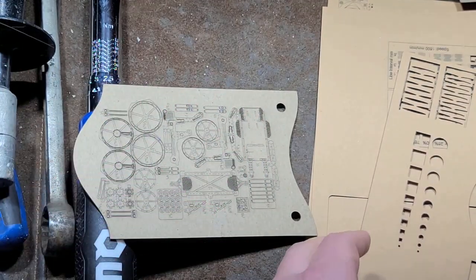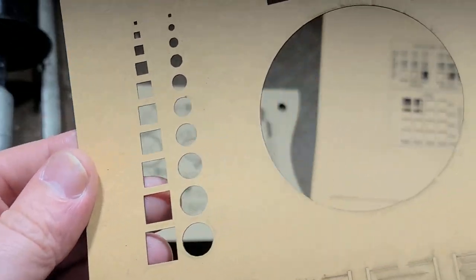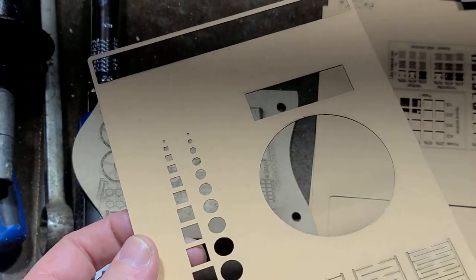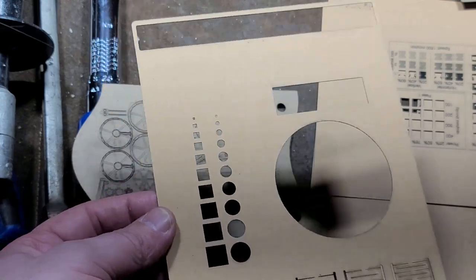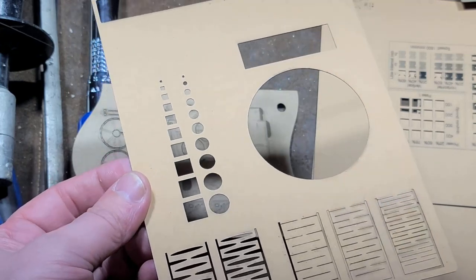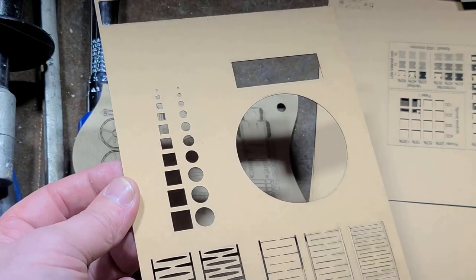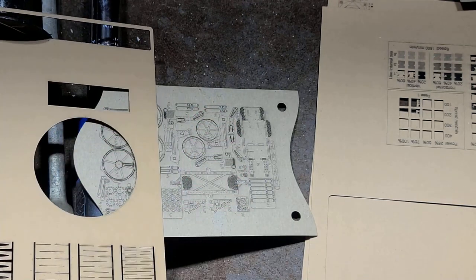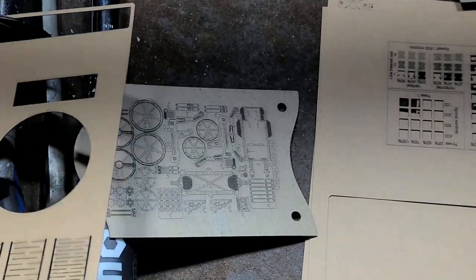Anyway, to finish up with the discussion and some samples, this right here is half millimeter cardboard, about 20 thousandths. It cuts it pretty fast. One thing to know about these lasers is power is semi-relative when it comes to the Chinese lasers, mainly because it's the concentration of power, or watts per millimeter squared. A 10-watt laser will have a tinier dot and deliver the same equivalent cutting power that, say, a 40 watt laser will, because the 40 watt laser will just have a bigger dot. So it's something just to keep track of. But otherwise, you can just cut out all these patterns. They're just super duper sharp.